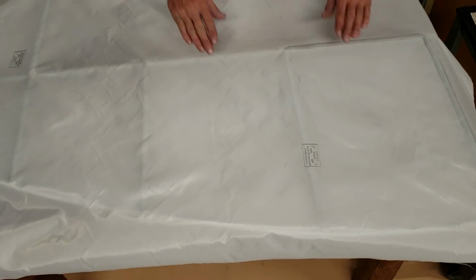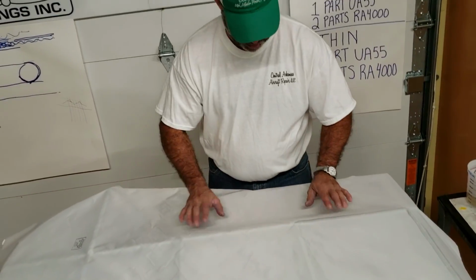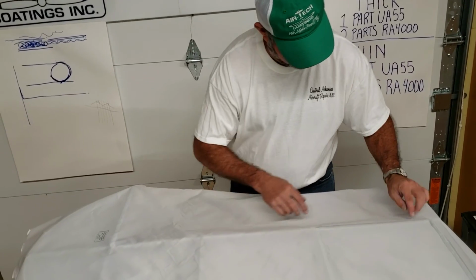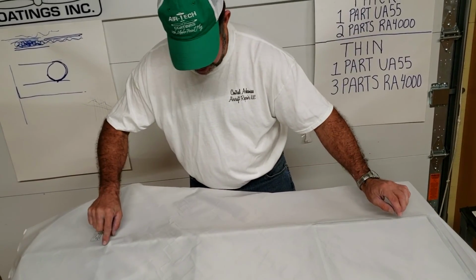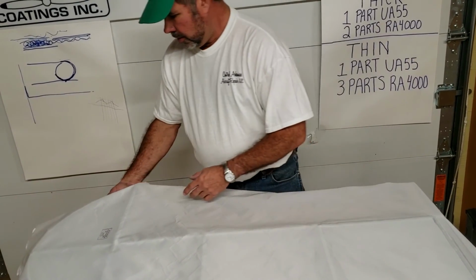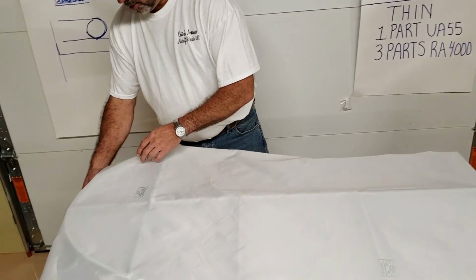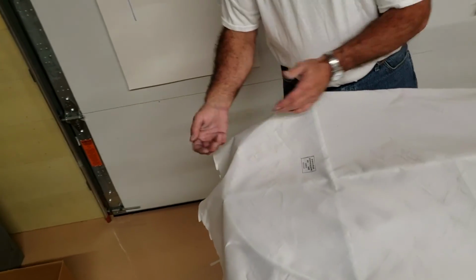Now you can cut this, like I mentioned, flip it over and lay the piece all the way around, and you can see through the other side, that pencil line. Like if this piece was coming up on the other side, you can see that pencil line. Then you go ahead and lay your straight edge and mark your edge on it, and that'd be something to cut a perfect line down. Same way, reaching it around, you can turn it around and use that pencil line this time to put your mark on the other side.